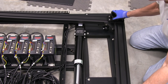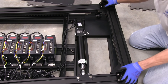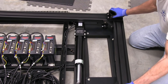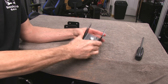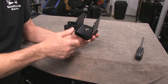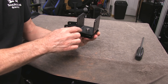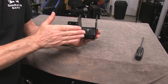Being free like that to move left or right is a very good thing as far as durability and long life of your actuators is concerned. The only problem was that this was a little bit loose — there was too much lash in this system — and that would make some noise when the actuator moved through it, stopped its stroke, and moved in the other direction.